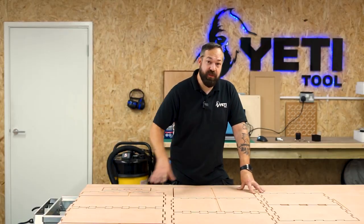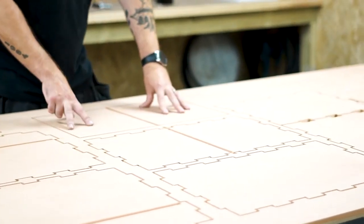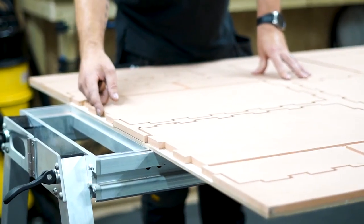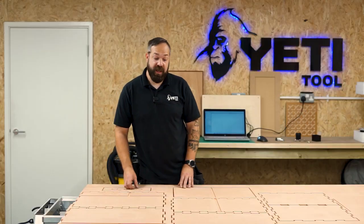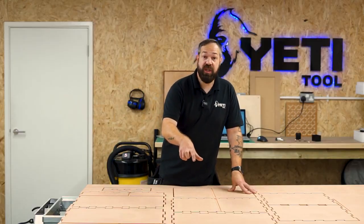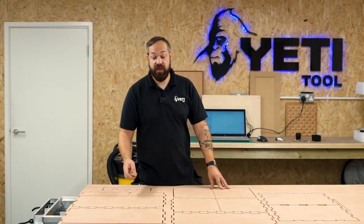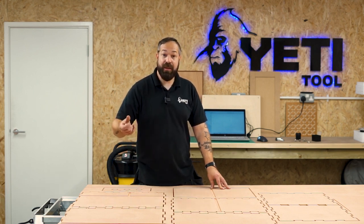So we've just finished the cut. Everything seems to work out perfectly. We've got the two ends, the central divider, and the top and bottom. Just a note — when I orientated these parts on the sheet, I came quite close to the edge and we had a touch of MDF breakout, which could have easily disturbed the X-beam and compromised the project. But we were very lucky in this instance. So it's worth thinking about how you're orientating your parts on your sheet to get the right level of finish and keep everything nice and safe. At this stage, we've got all of the parts still connected to the sheet via the tabs. We've used an off cut of our MDF to check that all our pockets are allowanced correctly to accept our 12mm material. I'm going to use a multi-tool to relieve all these parts before clearing the tabs with a flush cut bit in a router, and then we'll move on to the assembly.